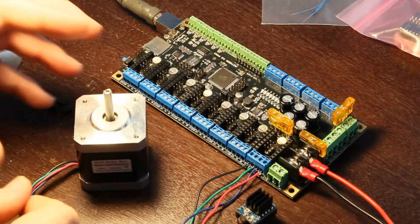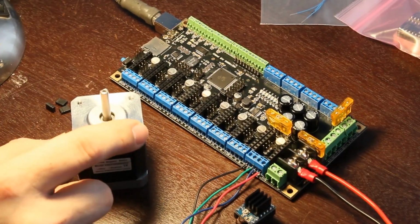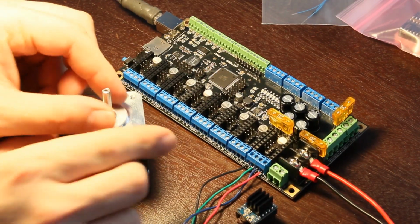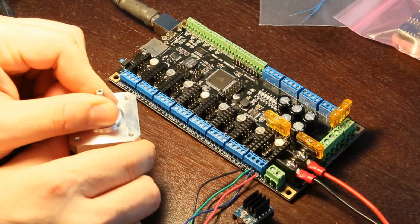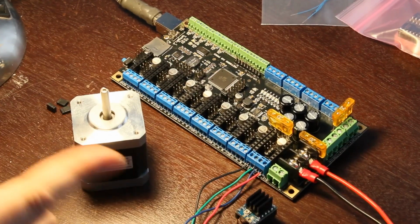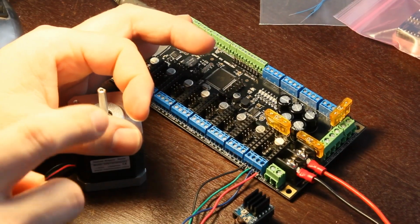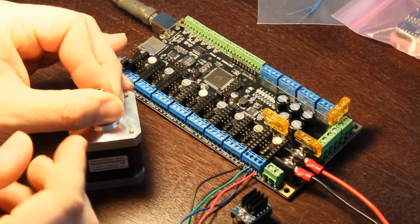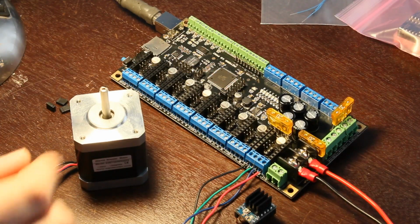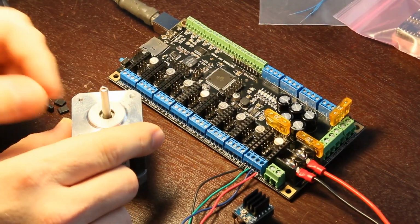Now, the controller inside it can do what they call micro-stepping. Micro-stepping is basically a pulse width modulation between the two coils, so it can actually sit between steps. And these steps feel so tiny, but that can be quite a bit of linear distance on your rails when you're going back and forth. Picture you've got a decently sized pulley on here, and it's moving the belt. So one click, you want it to be relatively small so you get nice, precise resolution out of your printer. Say half stepping would make it 400 steps for a revolution.